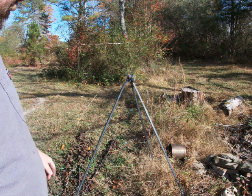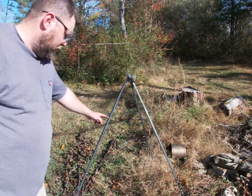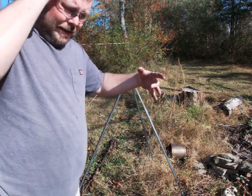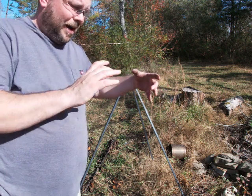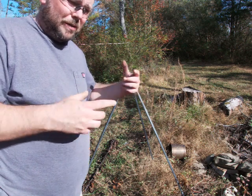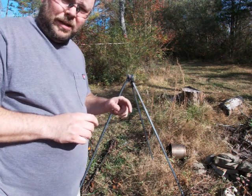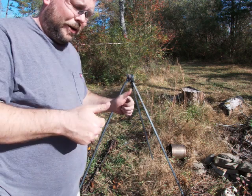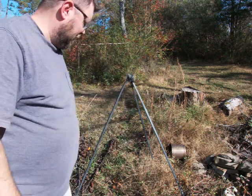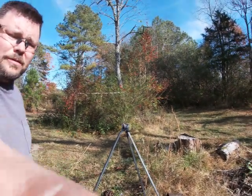We are also going to be making the prongs that hook onto your spit, which is what slides in and locks in place and holds the meat in. It's the sharp pointed things that slide in and lock the meat in place. So when you're rotisserieing and the spit turns, the meat won't fall off. And we will be actually drilling and doing a set screw, or we'll probably do some finger bolts so we can slide that in and tighten it up. We will be doing those in the next two videos. So let me adjust this up, guys. I'm gonna stay out here and we'll get real and talk about what we learned today.